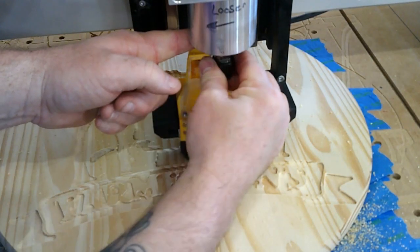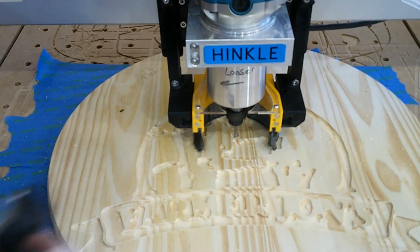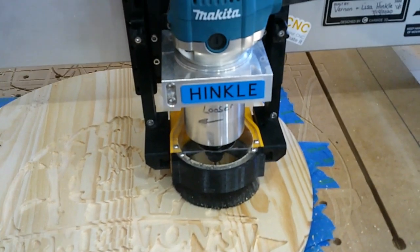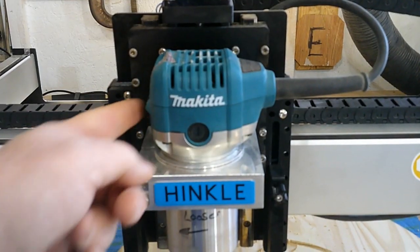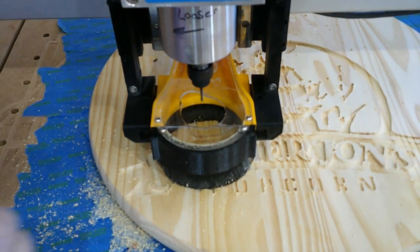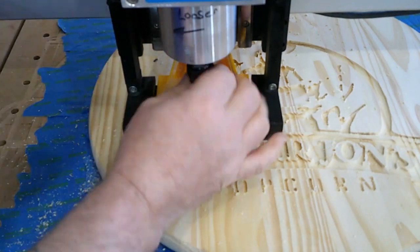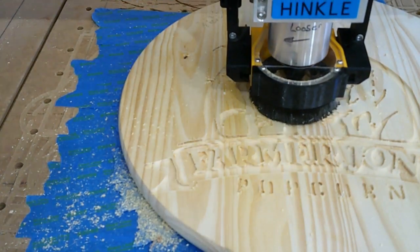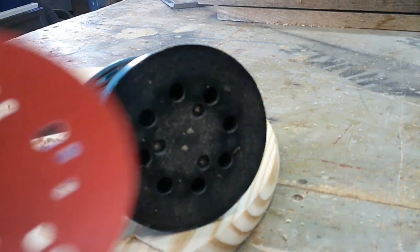Second bit was an eighth inch, obviously. Tightening that up, starting the machine, and we throw the cover back on once more. I'll leave a link to Pawn CNC tools in the description below — it'll help me out a little bit and I'm sure you'll be happy with it. Time for another tool change. As soon as the bit stops spinning, yank the front off, bring in the wrenches, take out the bit, put the next one in, start it back up. And as you can see, by using three bits it's able to get into the littlest nooks and crannies.